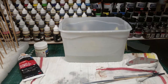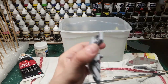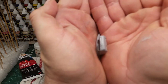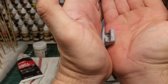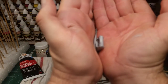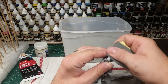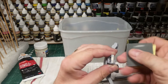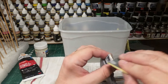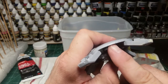This piece right here had some areas that need some love. Here's a good example — there are some pinholes right in there. So I'm going to dry sand this first before filling. I'm just using the 800 grit again and I can see some pinholes along here too — I'll fill all of those.